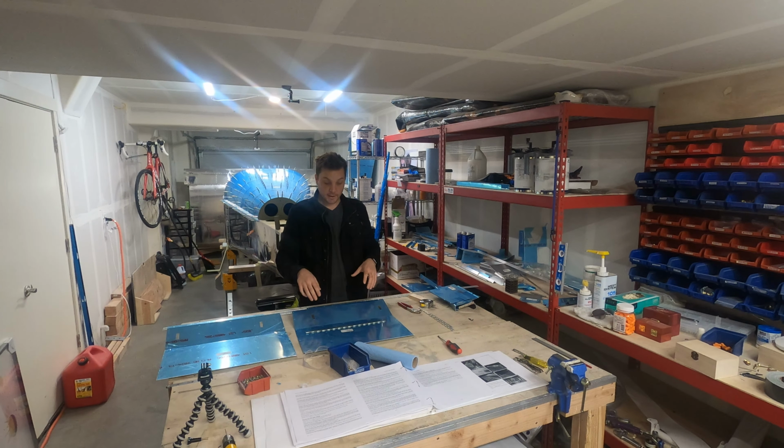So the majority of the work here is creating and modifying some piano hinge that will be riveted to the seat bottom. And that will allow for 3 points of adjustment for the seat back for varying heights of pilots. I've got some piano hinge pulled out. I also pulled out some scrap because I think I might be able to make it a little way with some scrap, and I want to save as much of this as I can because I think it's hard to come by right now. I'm going to get these pieces measured out per the plans and see if we can start chopping them up and looking at where they get riveted and lay out those holes as well.